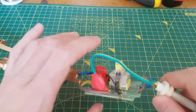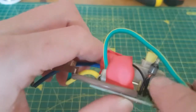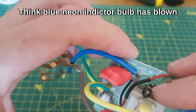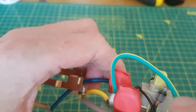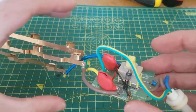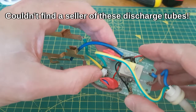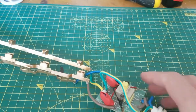The other thing I'm not sure about is this blue neon — it looks pretty black to me. The orange one works; the blue one doesn't. Now whether the blue one doesn't work because the surge protection wasn't working, or whether it's just the bulb burned out, we'll soon find out. I'm also going to look up this gas discharge tube and see whether they're cheap — I might replace that another time. But the MOVs are done.